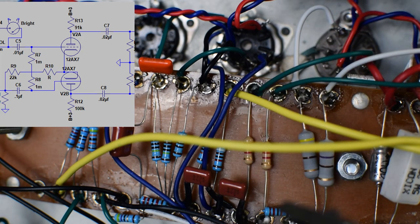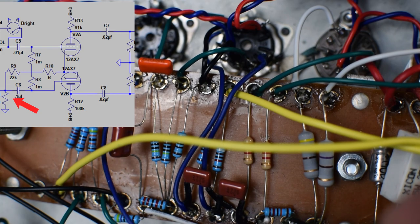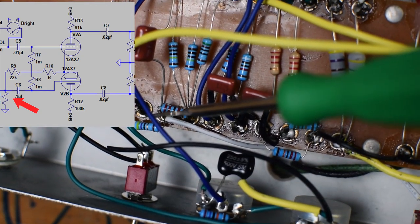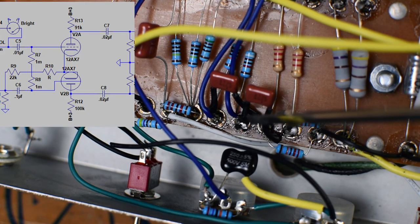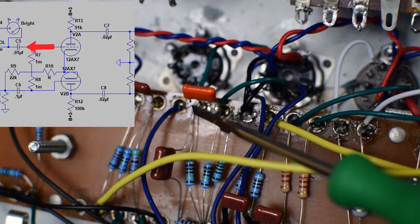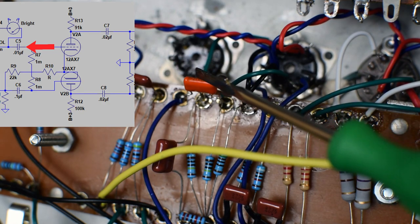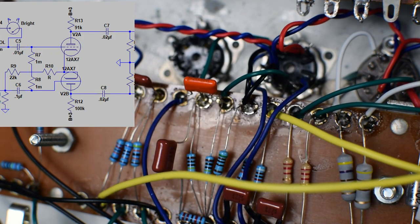Other than that, we're just using a standard Fender setup. I do have this little node right here where I am probably going to use some negative feedback. So I've got the option to do that right here. I will be sending some negative feedback to that point. But other than that, just a very standard long tail pair phase inverter. This capacitor right here is the entrance point to the phase inverter. This is a 0.022 uF coupling cap